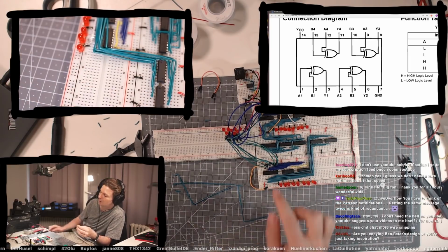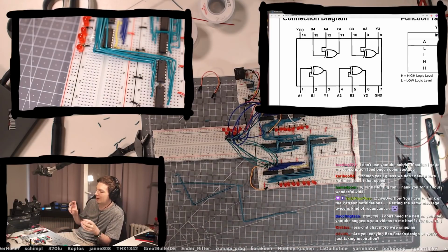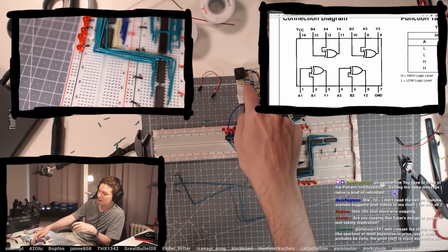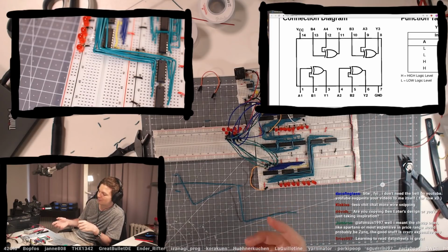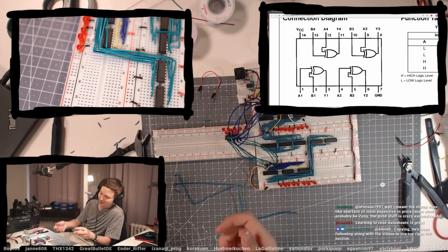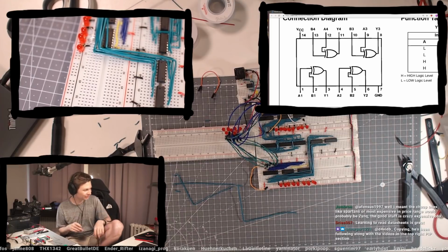And the second thing is, for example, the 555 timer up here, the fact that you can configure them based on hardware parts you put around them. A different resistor value and different capacitor values around this 555 chip can control how fast this timer will create a clock. So it's almost like a function or a config file for software, right? You can configure this hardware based on these hardware components. And I think that's kind of cool.